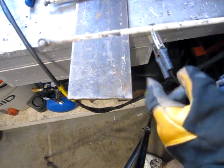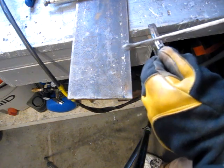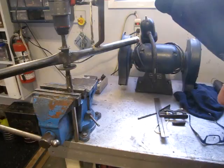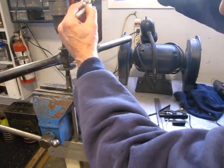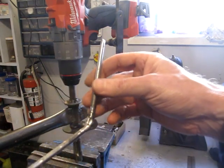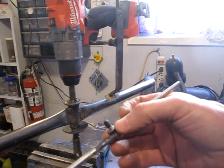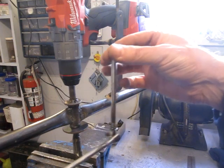Now I can cut this off at the right length and weld the bolt on the end of the other piece. When I thread it together, that'll make the swivel for the trigger mechanism. I think I'm going to want the bar about that height. So I'll cut this right about there. So here's going to be the swivel affair, and I'll just cut the bolt off. It threads into this welded on nut. So that'll create the swivel.